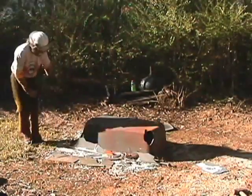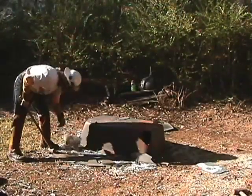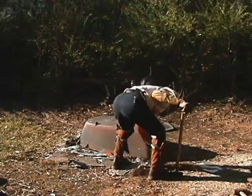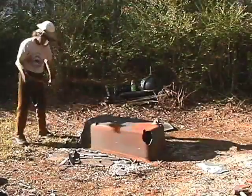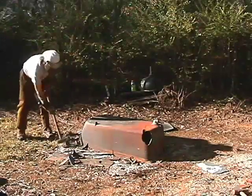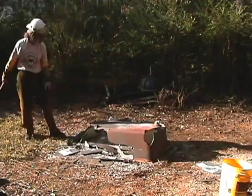Other hazards with the iron pile are the bystanders. That can be a really big problem. When you're breaking iron on the pile, I recommend one person breaking at a time. The other people stand back and maybe they collect it up and just swap out. If you're in a public venue, once again, the iron breaking is one of the deceptive parts. You wouldn't want to hit a kid in the eye with a piece of shrapnel. So roping off is important, and careful dressing out is important.